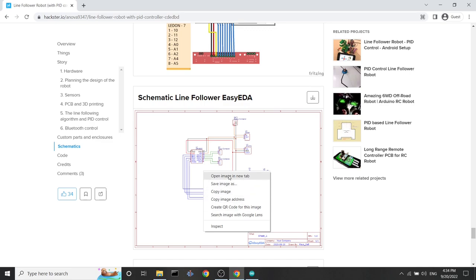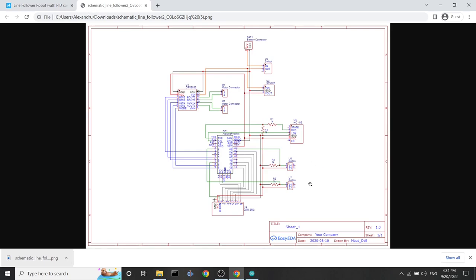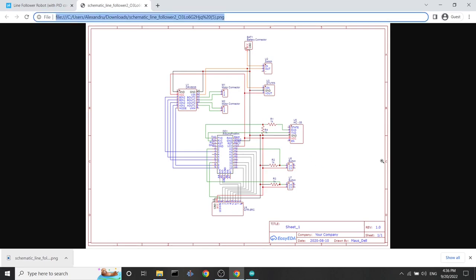Let me get the schematic. To develop code in Arduino, you always need to keep track of the hardware you are using. In this project we are using an Arduino Pro Mini, a motor driver, a Bluetooth module (not included in today's video), and the sensor array. This circuit schematic is important because it keeps track of the pins used by the Arduino — the motor driver uses about five pins, the sensor array uses about nine pins.